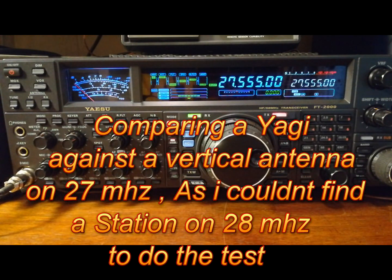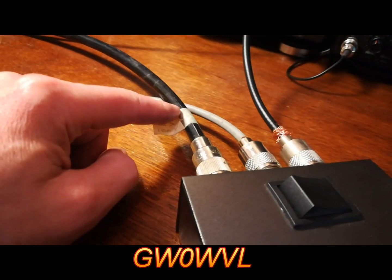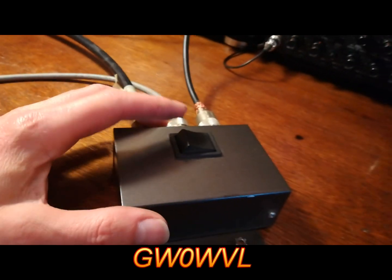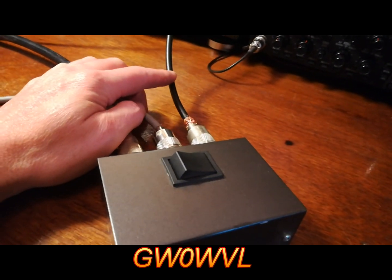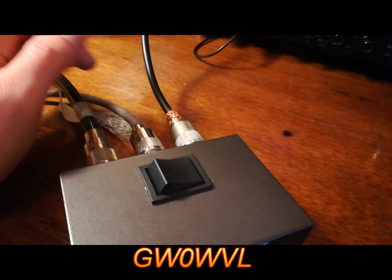Hello. Yesterday I changed my antenna and put my beam back up. I've still got up the 5/8 wave vertical — it's an aluminium vertical antenna, 5/8 wave, just one of those general aluminium 22-foot long verticals. That's on this antenna now. The switch works opposite; it's a rocker switch on a homemade switch box. So press down on this side is this antenna, press down on this side is this antenna. This antenna is the 5/8 wave vertical for 11 metres, and this antenna, which I put up yesterday with my shiny new Mini 8 coax, that's a three-element Yagi.